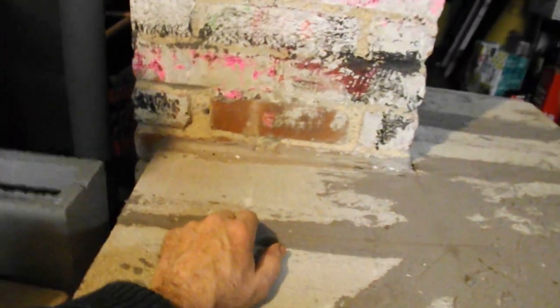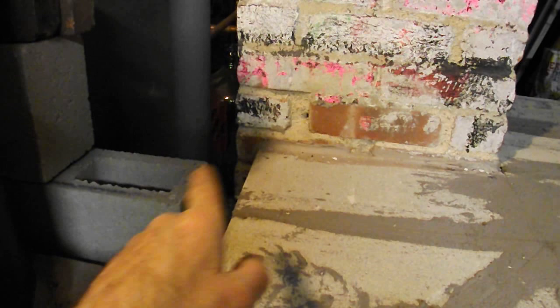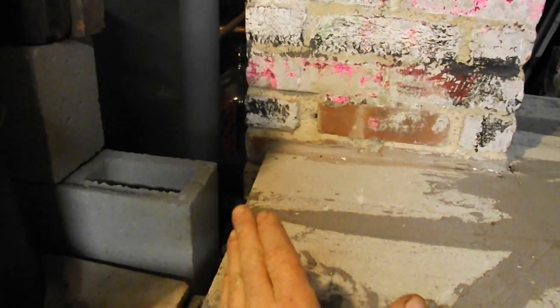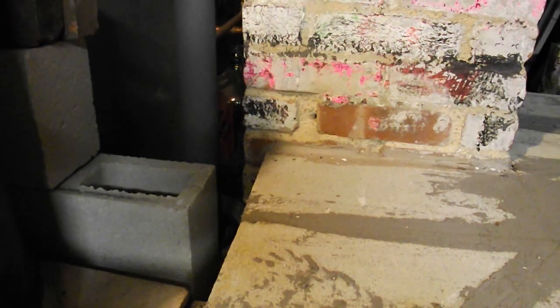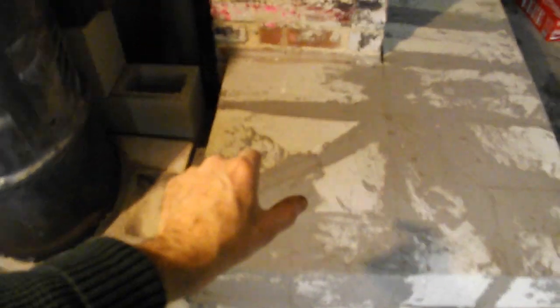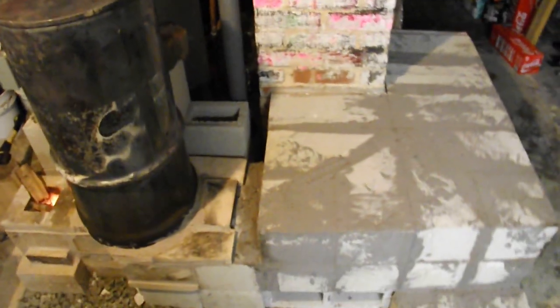The chimney — I removed one of the bricks. There was a brick in exactly this position, down here, one level, and it was a perfect fit for the cinder block. I coated the edge of the cinder block with more furnace cement, and I also coated around the opening where I'd torn the brick out with furnace cement, and I smooshed them together, creating a nice tight seal. It's bonded perfectly, and it seems like there's no fumes coming out or anything like that. So the gas path is: down here, goes down there, comes up, comes back this way, comes down this way, and heads back out my chimney. At this point it's quite warm there — we have actual hot gases going up the chimney. So that's worked out very well.